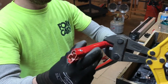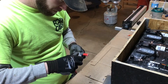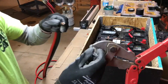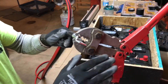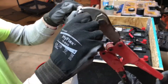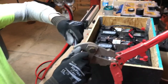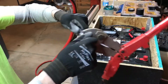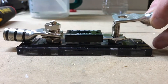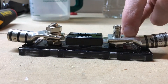The hardware store didn't have any more 2-gauge cable, so we bought some heavy-duty jumper cables to connect the battery bank to the inverter. The swager we're using to crimp these connectors onto the jumper cable wire is not designed for this application, but we made it work. The connectors also had to be bent to fit onto the fuse block we purchased, to ensure a good connection — as you can see on the right versus the left.